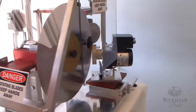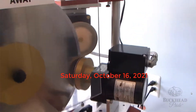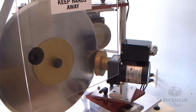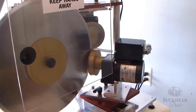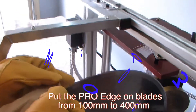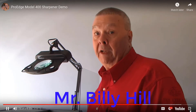I used my business, Mirror Edge Sharpening Service, to get a direct audience with him. I sent a request and he contacted me today. We discussed the problem, I showed him the videos, and he confirmed this is indeed the problem and provided the solution — even the part number, which is M400-0013. We would need two of those arbors, and I've already asked Selena to purchase new CBN grinding discs, two of each grit. Thank you, bye.